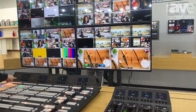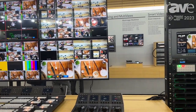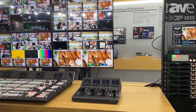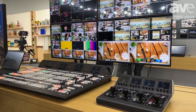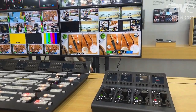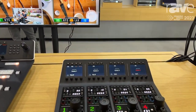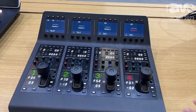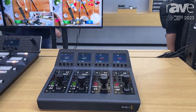We have the switcher set up with the HyperDeck, allowing us to play back pre-recorded content or record to the HyperDeck as well, and that's done via IP connectivity driven from the ATEM switcher. We're also showing the SDI-based camera control — we've got our ATEM camera control surface here driving connected Blackmagic Design cameras. So if we're working with the URSA Broadcast G2 or the Studio Camera 4K Pro, we can drive that directly from the ATEM camera control panel, which is connected into our switcher via IP.